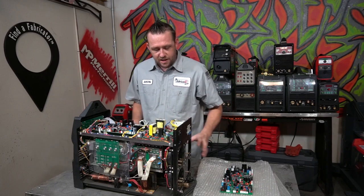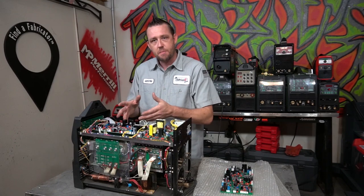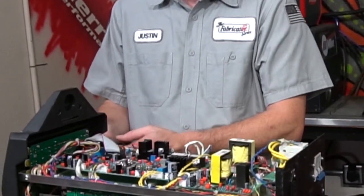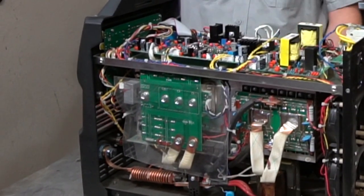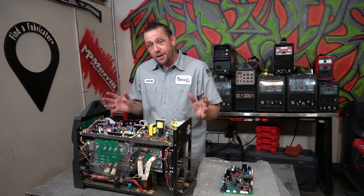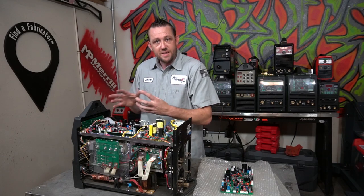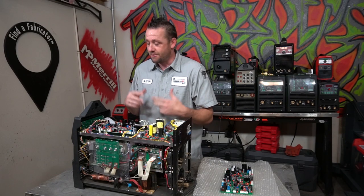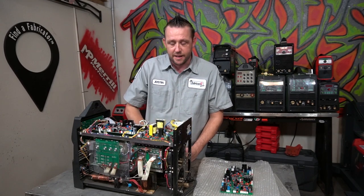If you had to take more of this apart, you could see where the screws are and find out where they all line up. The face does not need to come off of this to do this repair, but if it did, the screws on the inside hold the face panel — there are some down on the bottom that hold the lugs and the dinse connectors to the panel itself, just like there were on the back panel. All you got to do is find the screws. Here's a careful tip: if a panel doesn't want to come undone and you think you have all the screws out but something is snagging, find that screw — it's probably in there somewhere. We've got to replace this board on top. Super simple to do.